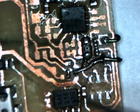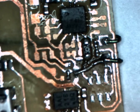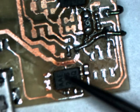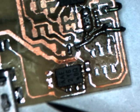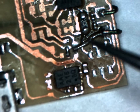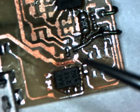The battery protection circuit did work when I first tested it, but I didn't get a chance to test it with the charger. The charger did complete its testing, so I got that soldered in, and after I added that jumper, it of course has a ground, and that charged the battery no problem.